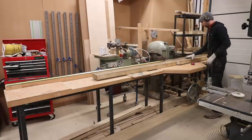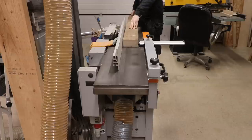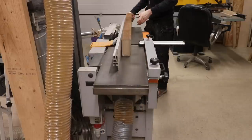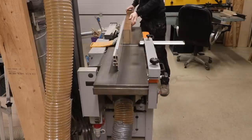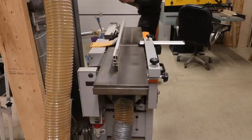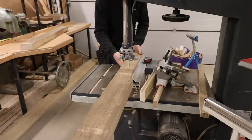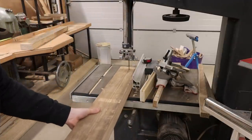It's dead frustrating when you go back to a project in 6 months' time or 2 years' time down the line, and there's cracks on all the joints, and the door gaps have opened up from, say, 1.5 to 2 mil to 3, 4, 5 mil gaps because the timber's acclimatised to a room that it wasn't acclimatised to before, and it's just ruined everything. So I like using the Accoya because it negates that evil in that it doesn't move.